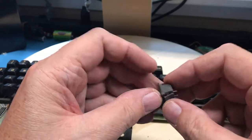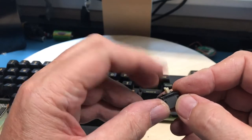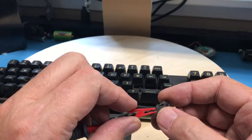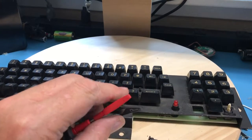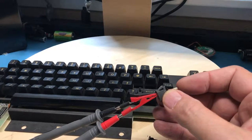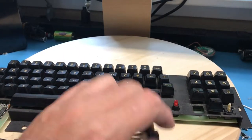My fear at this point is that the large amounts of strain I've put on that post trying to get the keycaps off - this is the one I originally broke - has deformed a contact inside. If I put the ohmmeter on the broken one, I get no indication of continuity at all. Let's take the enter key that was intermittent and try it - also no indication. Going back to straight ohms to see if it's just high resistance - it's not. So no indication that switch is working either.